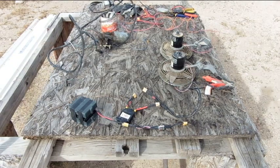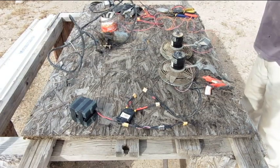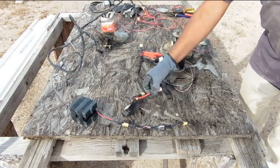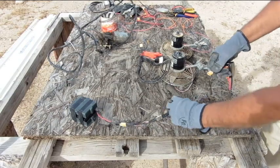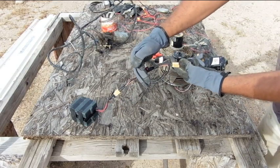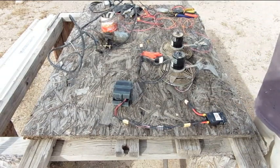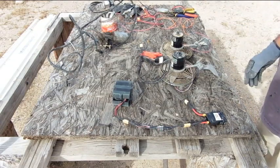It's kind of the same setup as yesterday. I'm always nervous at this table — I make sure there's no rattlesnakes underneath; always a possibility. So I've got a master switch which actually has a breaker in it — overkill, but whatever. These connectors are XT60s. I've got a voltmeter here showing 12 volts off my little battery. This battery is 18650s and it's got a BMS in it. Yesterday I accidentally shorted it and the BMS just shut off really quick — no problem. I disconnected it, waited a couple seconds, hooked it up and it worked fine.